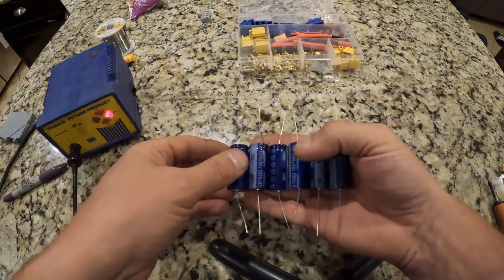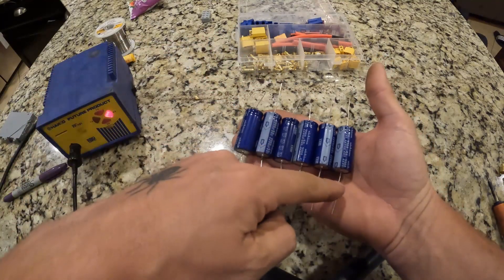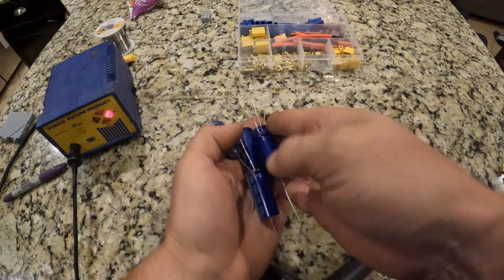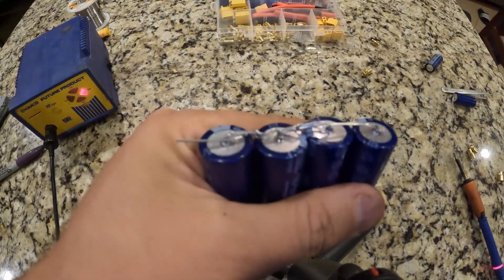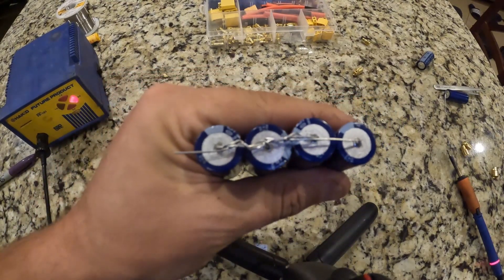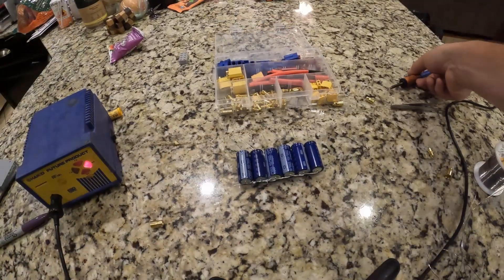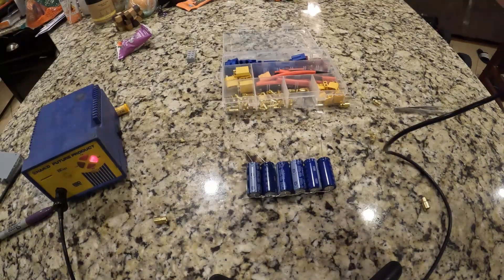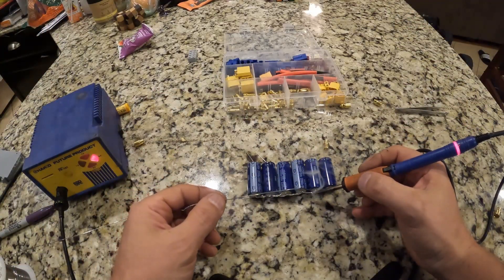What I'm going to do now is solder each and every one of these wires together to have them all connected. I'm going to use a piece of plastic on top and on the bottom to have basically a brick — like a battery brick. Right now I'm basically weaving the lead wire from one capacitor to the next, weaving them in place, and then after that I'm going to cover all that with solder.